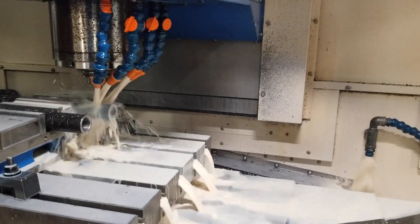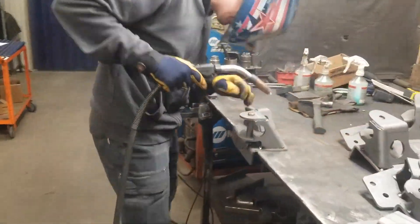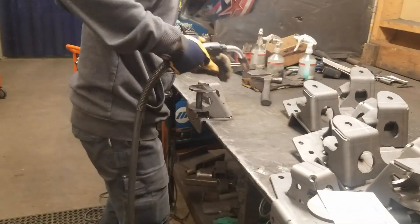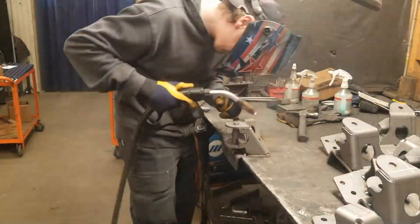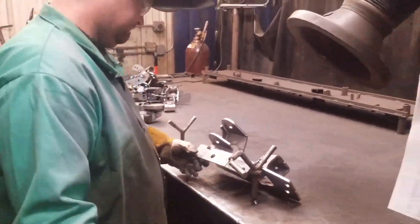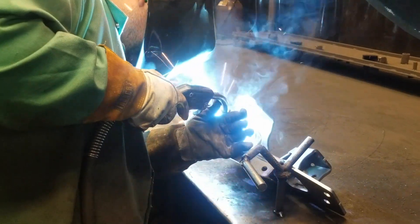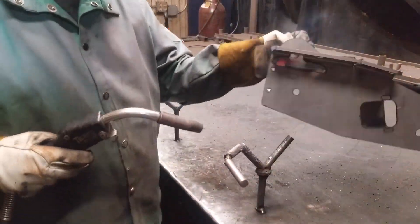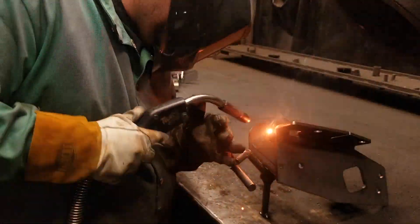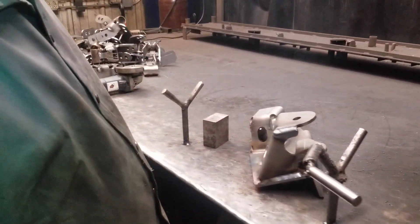The brackets completed in the laser shop are also ready to be welded. In the weld shop, the brackets are tack welded together using a spacer as a gauge to ensure proper bushing width before final welding. Final welding puts a lot of heat into the steel, and if the parts had not been tacked together first, the bracket could be susceptible to warping. Setting up for final welding this way keeps our finished product accurate, square, and strong — and of course a perfect fit to match the original 3D CAD drawing.